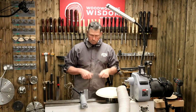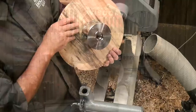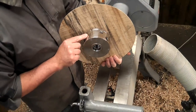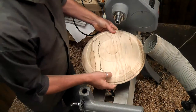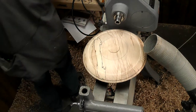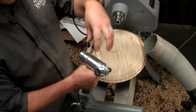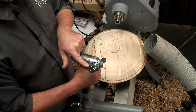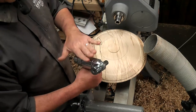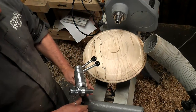All right, cool. So I've just taken the bowl. At the moment, we're on a chuck, SK114, and on a faceplate ring as well. I've got another one down there. We're just on a normal faceplate. But the pro mount that I was talking to you about is this piece of kit here. This one comes with its own stand and also a carving head. We haven't got the carving head. We've got the M33 by 3.5, so the same thread as I've got on my lathe here, which I can now attach all my chucks and things to.